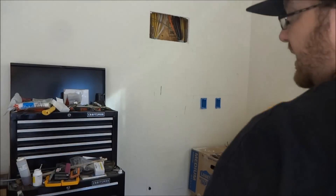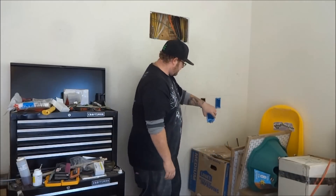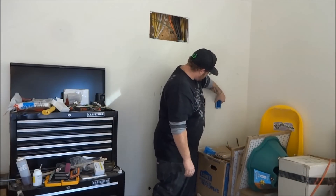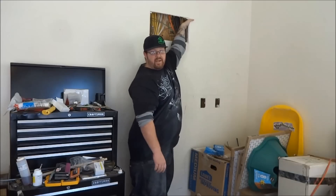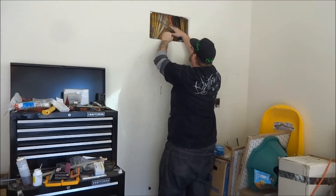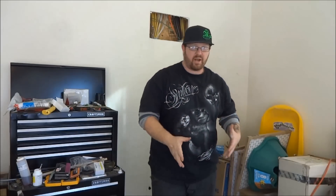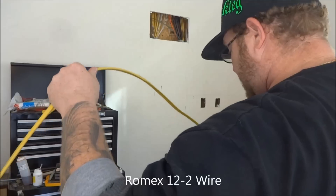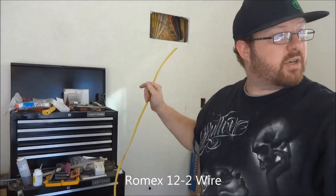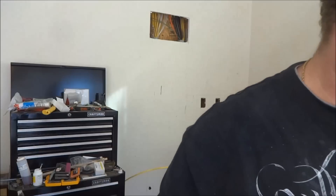All right guys, the camera died. I didn't go too much further ahead — just the basic stuff like drilling the holes here so I can get my wires and drill the hole up into the 2x4 so I can get the wire ran down and through. We've got a wire to fish. Because I'm running a 20 amp circuit breaker, I'm using 12-2 Romex to run a double wall outlet.